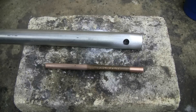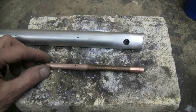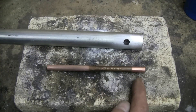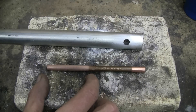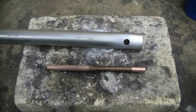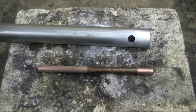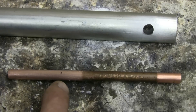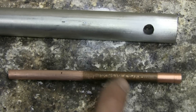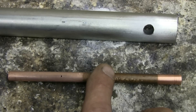The second part of this burner is the copper tubing. This piece is about five inches long. I've cleaned a little bit at one end, and then about two inches at the other end so that it can be soldered. The main thing about this copper tube is that about an inch and a half to an inch and three-quarters from the end, I've drilled a number 62 hole to form the gas orifice. You can use a regular drill with a collet chuck adapter and a small number drill set to drill this hole.